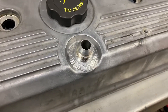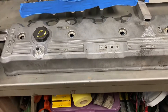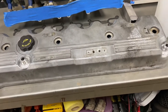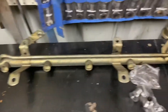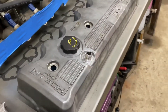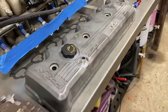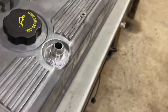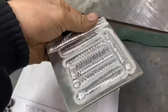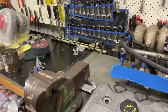Always learning. 4043 filler, 65% balance, number seven cup for the most part, and a gas lens. I'm a fitter and turner, not a boilermaker. I've only been welding for about a year and a half so I wouldn't say it's too bad. In other words, I can glue two bits of steel together - that's for sure.